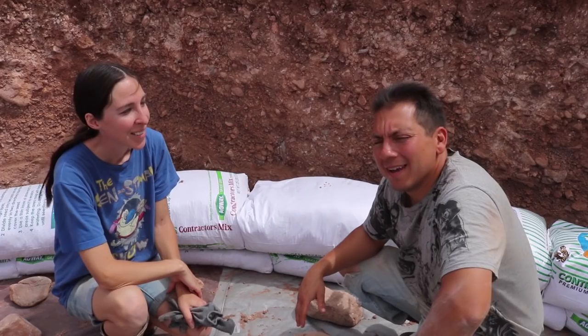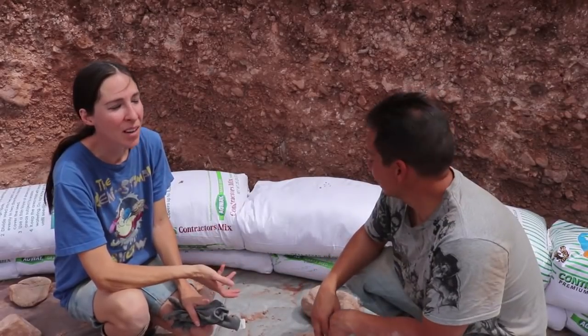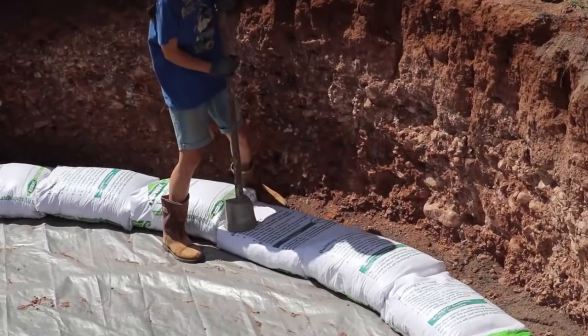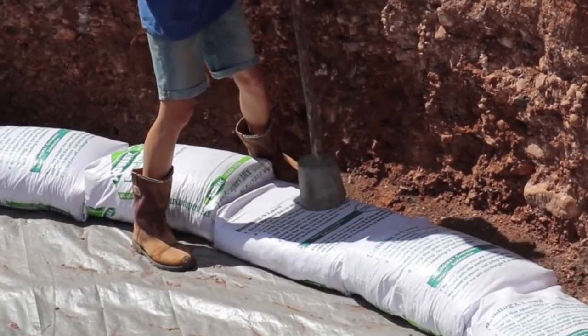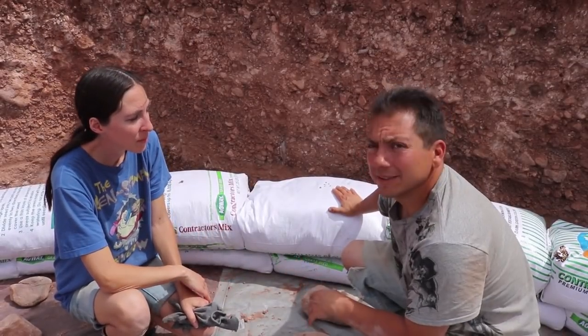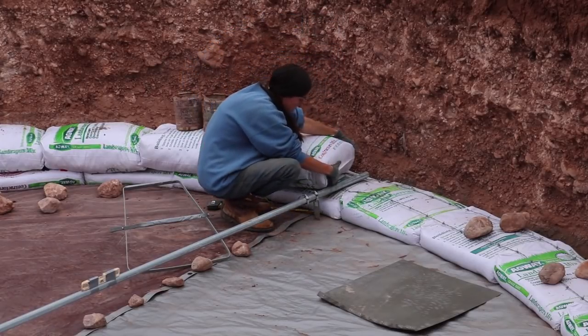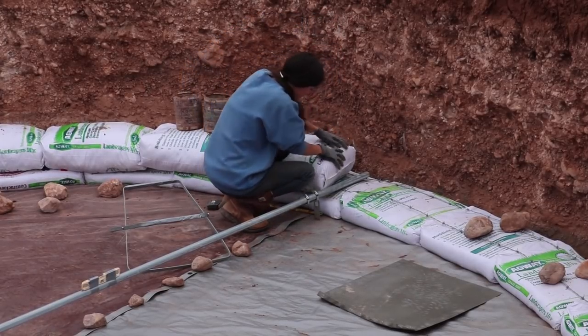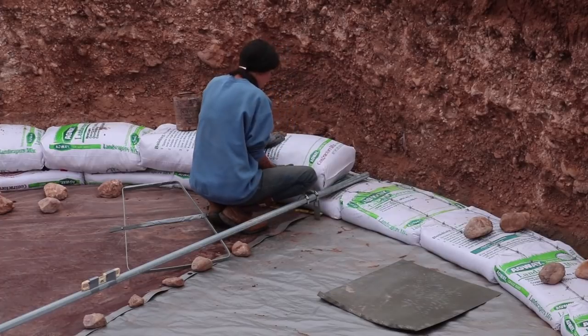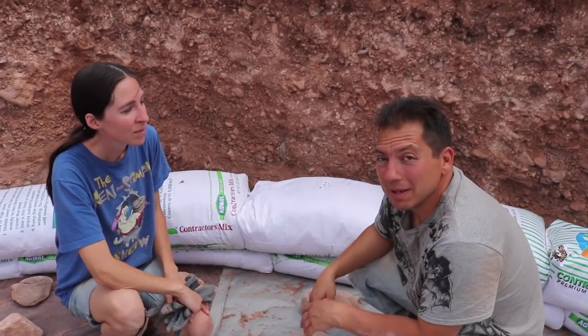These things are heavy, and not only that, but they've been tamped solid. And that probably would have been a bad idea anyway. Since they already are compacted and starting to dry, we don't want to disturb them too much. What are we doing to correct this? We're correcting the subsequent layers, and if they are off significantly, we'll just kind of shift them gradually as we go up. So we'll just bring them in incrementally. That shouldn't be that big of an issue.